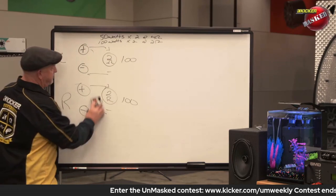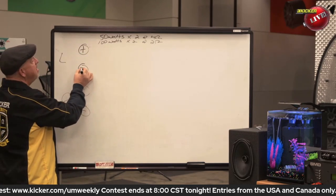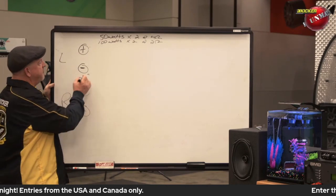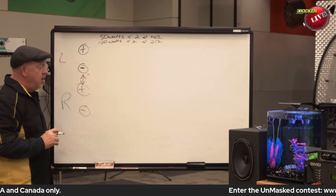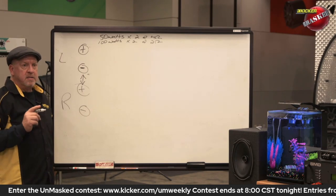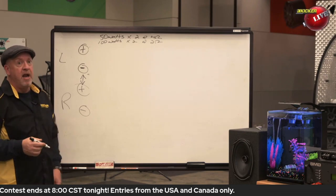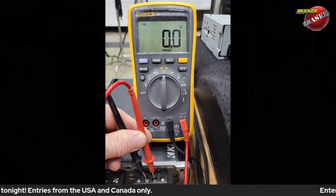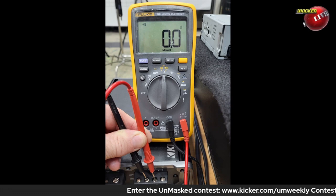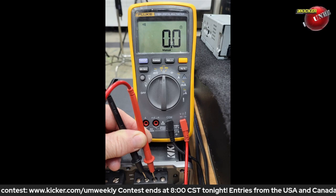What gets really interesting — and I have some pictures to show you this — these two terminals right here, the left minus and the right plus, they are the same electrical connection. There is no difference; these two are basically tied together. I've taken the amplifier we're going to show you in a minute, taken an ohm meter, and measured between the left negative and the right positive — those two center terminals are a dead short. So those two terminals are basically interchangeable; it does not matter which one you use.